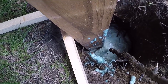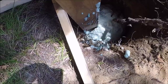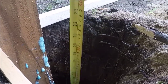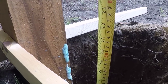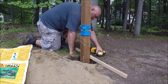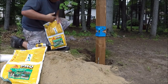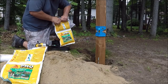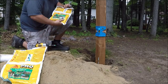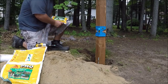The 3 minutes are up — let's see how hard it is. You can see here that the foam expanded up the hole about 18 inches. Let's take the supports off and see what we got. I wasn't really satisfied with the strength of the post and how sturdy it felt, so I'm going to put another bag in. Like I said before, I didn't get enough of the Sika all the way around the post — on the back side there's only about a 2-inch gap, and it never flowed around behind the post.